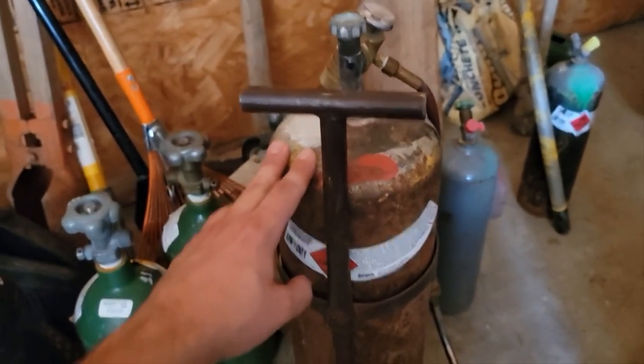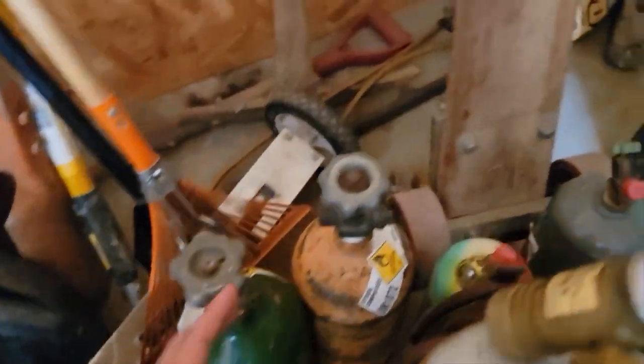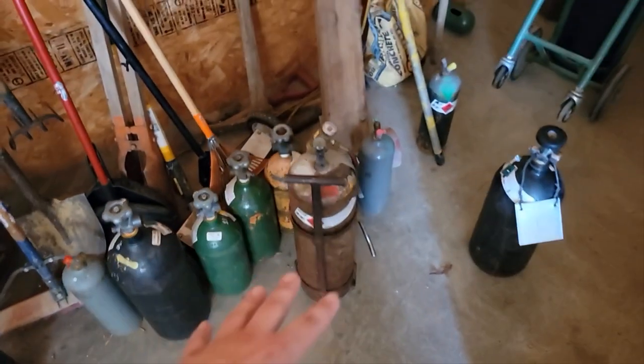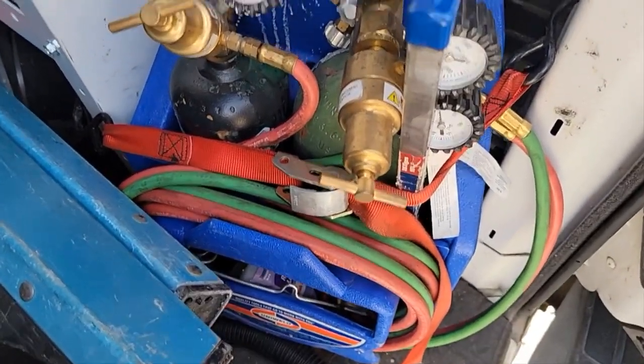You may be able to use a turbo torch to fix a leak in a copper coil, but for a micro channel coil you will most definitely need a map gas torch or oxy-acetylene — you will not need a big flame. This is the oxy-acetylene set I use to repair the micro channel coil. If you're purchasing a new unit, I wouldn't be scared of micro channel coils — just make sure you have a good contractor and a good maintenance plan, getting your unit serviced and cleaned at least once a year. It takes a lot less dirt inside a micro channel coil to make head pressure rise, so stay on top of the maintenance.